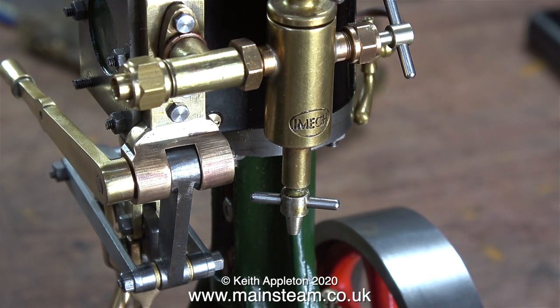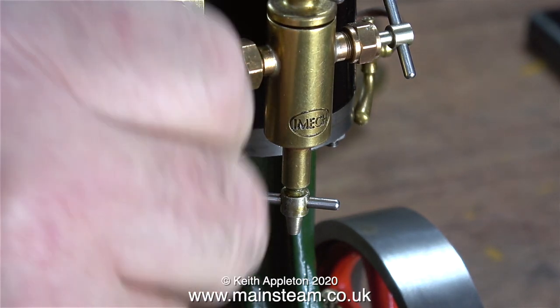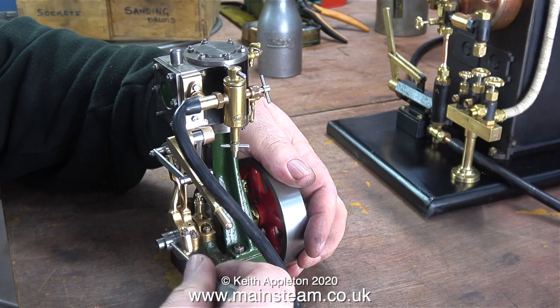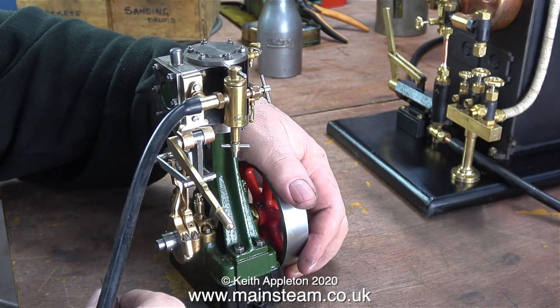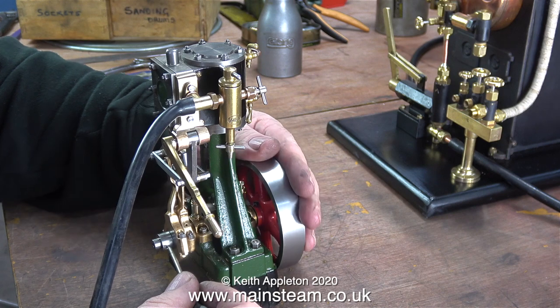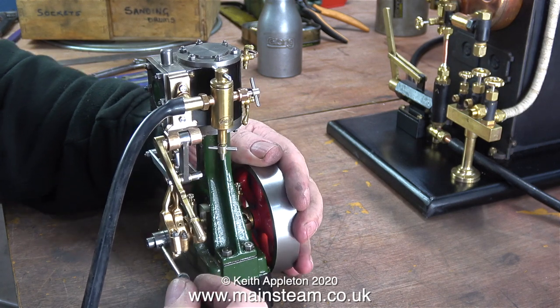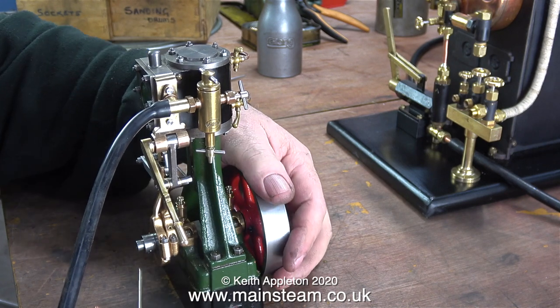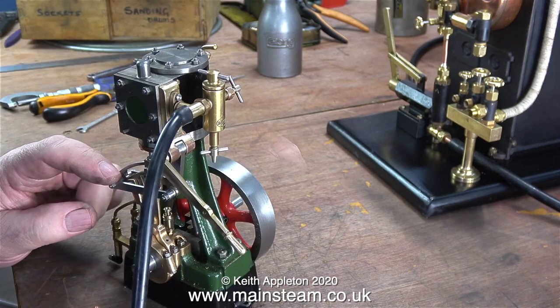The main purpose of this episode is to show how I fit the valve gear together and to find out whether the engine will run in forward and reverse. I'm going to attach my compressed air line to the engine, and I'm setting the position of the eccentric — the highest point of the eccentric lobe needs to be at 90 degrees to the crank web. This is the starting point. Time to turn on the compressed air.